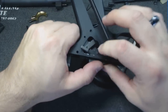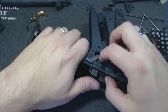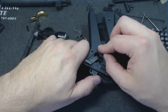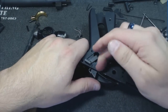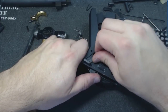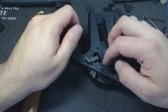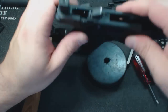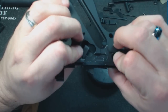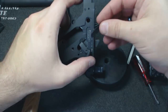And so, that's under enough tension that it's going to be off kilter, but when you lay it on one side to provide the pin pressure, you can then use a combination of thumbing the hammer back and using the safety, which is hooked around that, to basically guide it off into the hole. All right, so eventually we're going to push that the rest of the way through when we're ready to hook the side plate here.